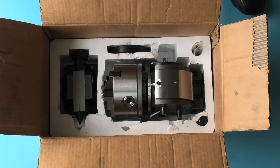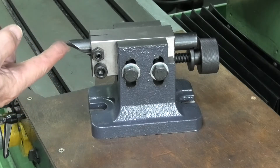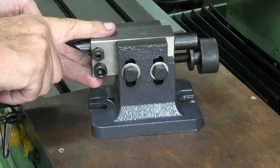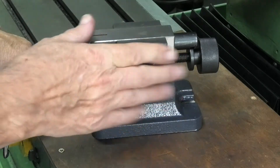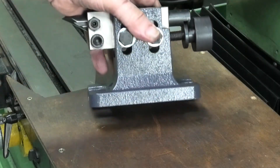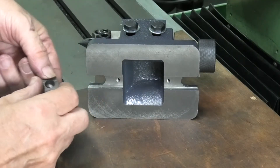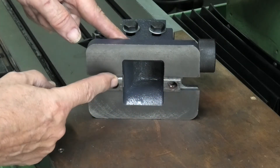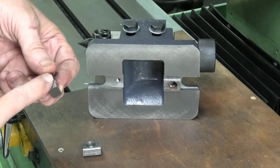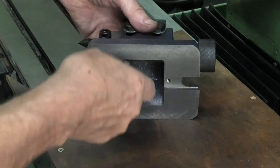So we'll take these into the workshop and have a look on the milling machine. First of all we'll take a look at the tail stock. It's quite a simple tail stock — there's a centre at this end which is held in a hole. These clamps tighten the centre up. This is height adjustment so you can set the height to suit your dividing head. Once you've set the height you don't need to touch that again. On this end you have a knob which feeds in the centre. Underneath there's a slot, and in that slot the keys fit. The only problem I have on my machine is the slot in the table — these are a bit big, so I'll need to mill a bit off the side so they fit. That's good in a way because I can make it an exact fit for my machine, and it has exactly the same key arrangement on the dividing head.